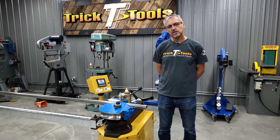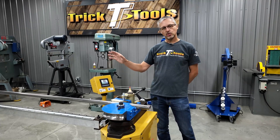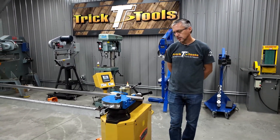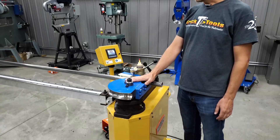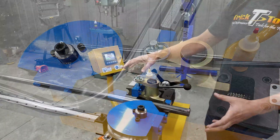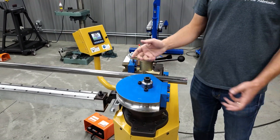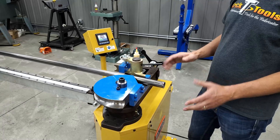I'm just going to go over some of the features of this machine. We're going to talk about the setup of the positioning table and we'll show you how that all works with the indexing table to bend a multiple bend part. You can see on the machine it's got a really nice drop-on tooling design. The counter bend die that swings out of the way allows you to just drop your tube right in there if you're making a small part. There are two bolts holding this die set on, but the die just slides right off, so it's really quick and easy to change to a different size of tooling.